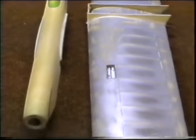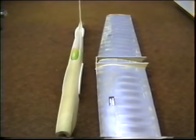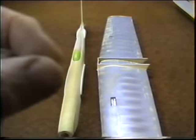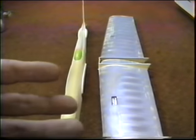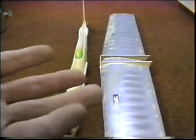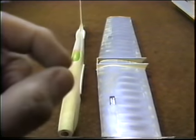Now again, one of the things you could think about doing is letting this dry overnight, but we have about another hour left in our little building session. And I really don't like to sand primer before it's dry overnight, but I'll wait till the very last second, just before I quit for the day, and then just brush on one more coat. And tomorrow it'll be ready to sand, and it'll have that quality. When it dries overnight, especially if it's up by a heating vent, it tends to, in the morning, just powder right off.